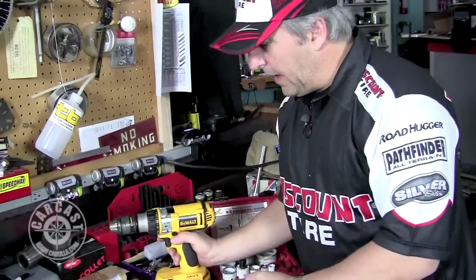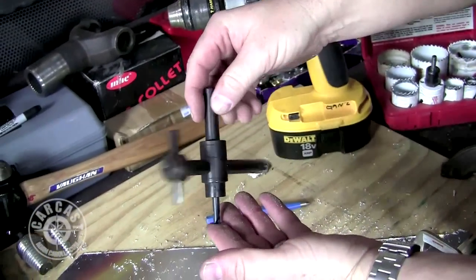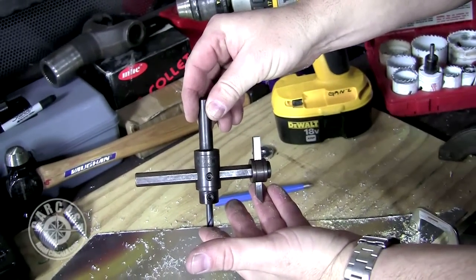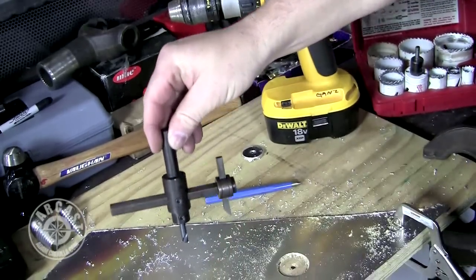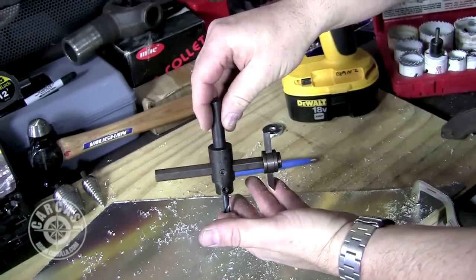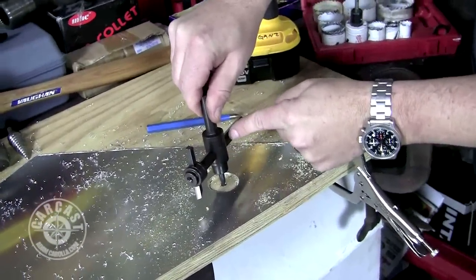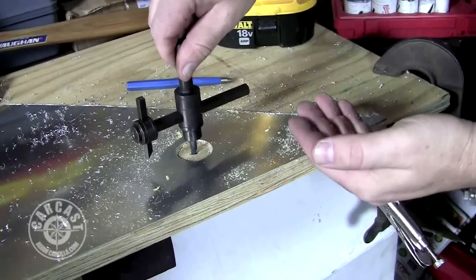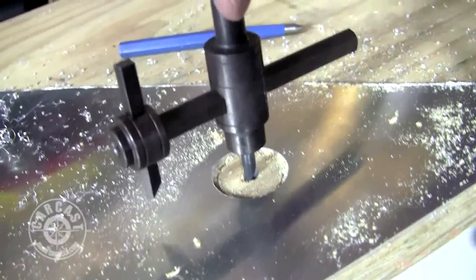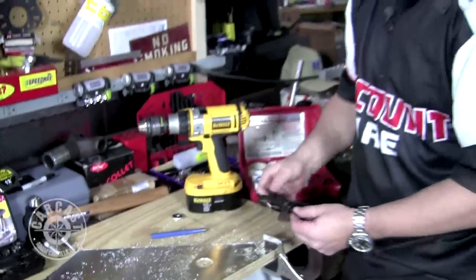The next one you might see — sometimes more for wood cutting — is an adjustable circle cutter. This one's made by General Tool, a really nice piece, about 30 to 40 bucks. It can drill a hole up to probably about eight inches in diameter. This is basically a drill press-only tool. You could try it on a hand drill, but it doesn't work really well. On a drill press you want it to come down straight and then it spirals around. You adjust the size of the circle by sliding the bar out, and the cutter is replaceable. It'll cut steel and aluminum, but it's a little awkward because it has to be in a drill press.